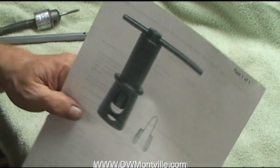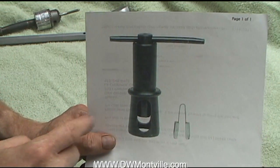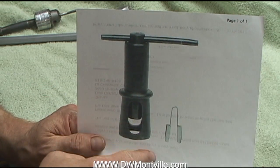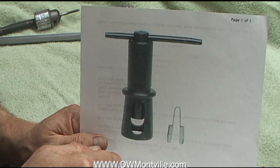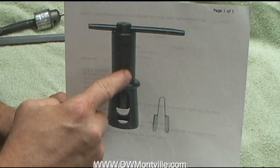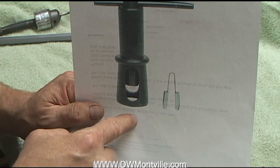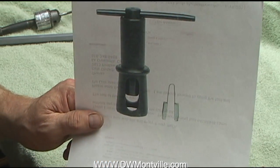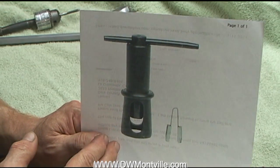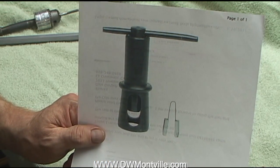The one I bought to initially do that looks like this. The way these work is this right here is effectively a standard tap handle, but the outside bore — the tap handle fits into the sleeve and holds the tap perfectly true to the bottom, which of course sits at a perfect 90 degrees. I bought one of these and ended up bringing it back because the tap was on an angle, describing a circle of about three-eighths of an inch at the end. Since it's so rigidly held, there's no way to correct for that. When I brought it back, the other two they pulled off the shelf were made exactly the same way — an extreme waste of really good metal.